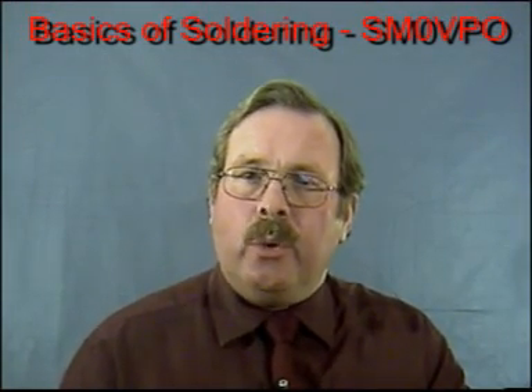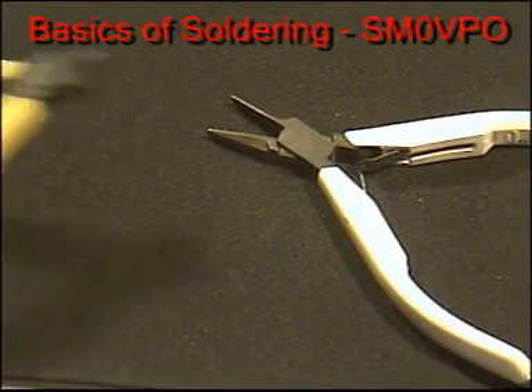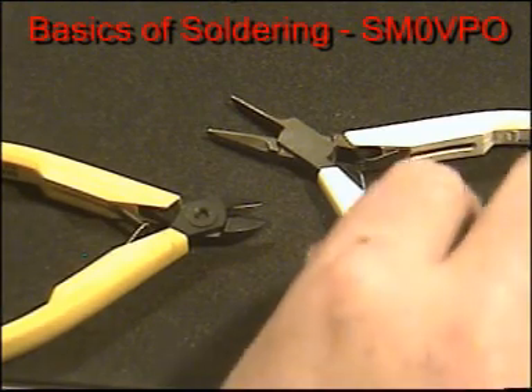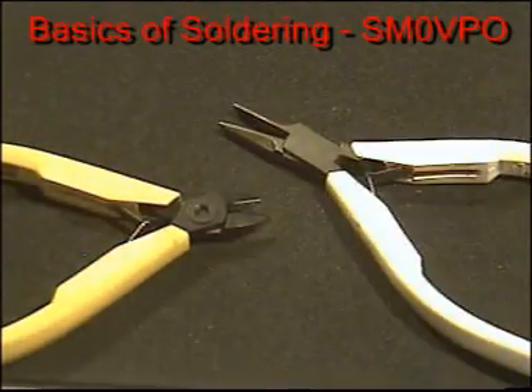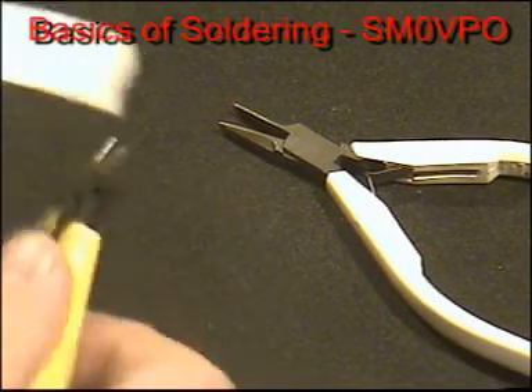To prepare a solder joint, you will need a decent pair of pliers and a pair of cutters. These two items are quite important and should be chosen with care. Pliers should ideally be flat-nosed and capable of gripping a thin strip of paper. These will be used for forming component leads and even as a device for diverting heat from sensitive component wire leads.